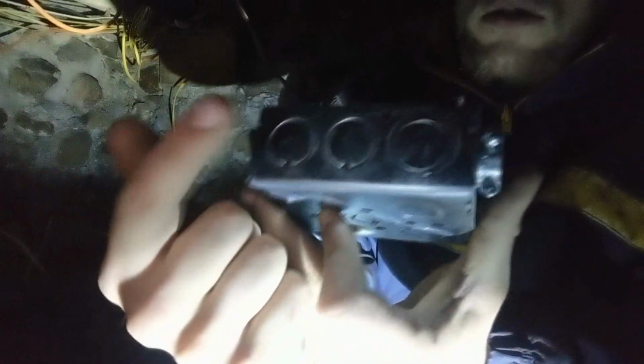They're an inch. So, what this box is for, I'm going to put you guys down just a little bit so you can see what I'm working on. Now what this box is for, it's called a junction box. These are knockouts. You take a screwdriver or something to hit these out with a hammer. And this little thing will pop out, but it won't pop out all the way. So you just take it and you twist it until it breaks off from it. It's supposed to do that.